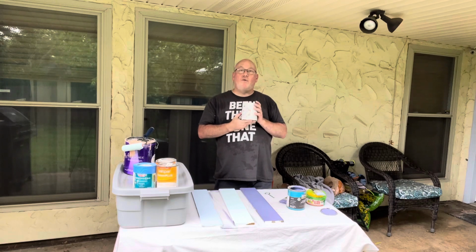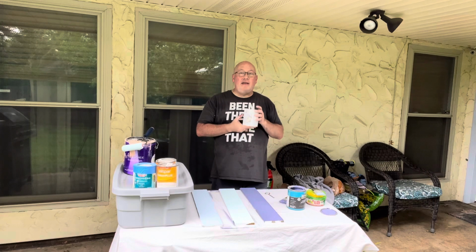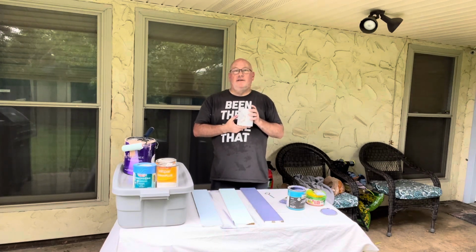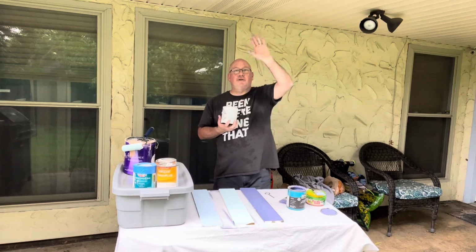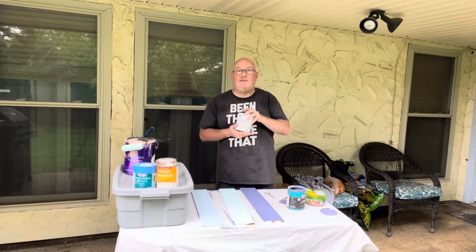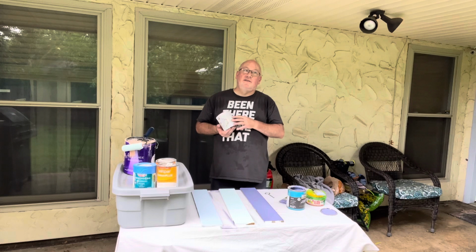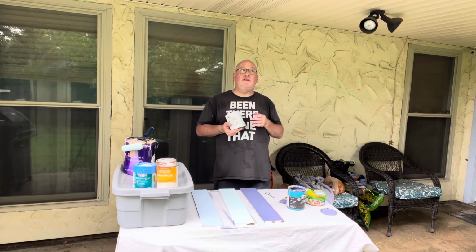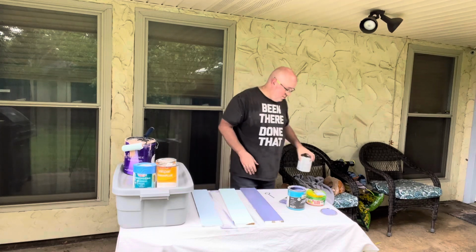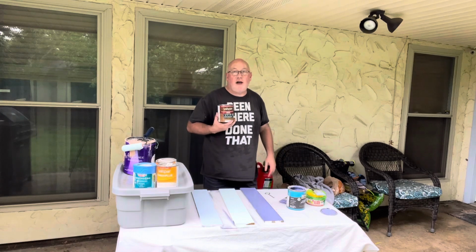Let it sit for 48 hours, not one day, but 2. And then sand, okay? And then wipe. And then, once you're sure that the surface has been roughed up and smoothed out to a dull finish with some fine sandpaper, such as a 320, a 400, or a 600, then put your primer away and go after some other kind of paint.